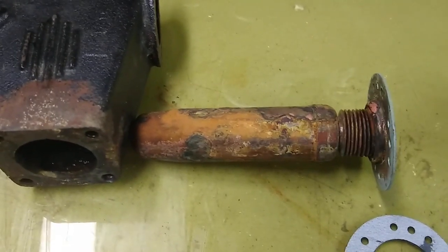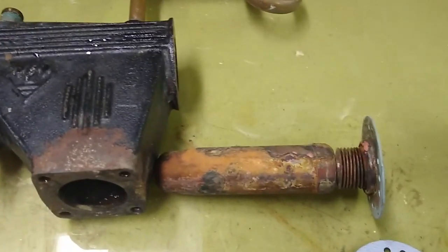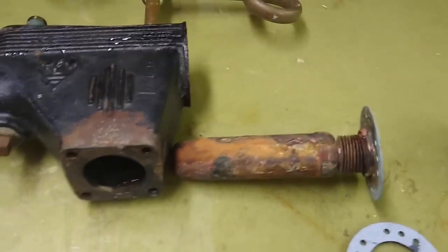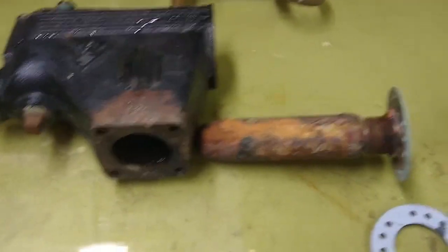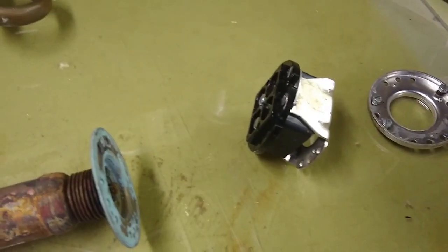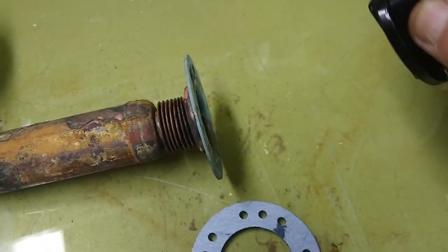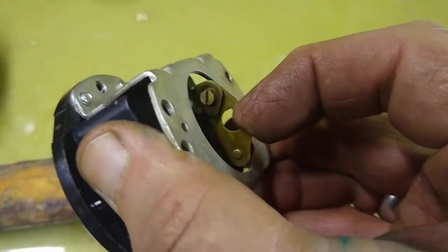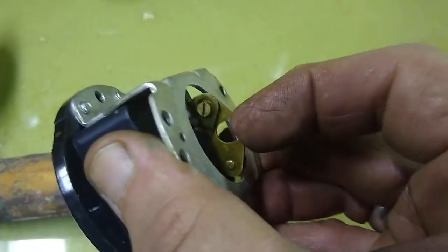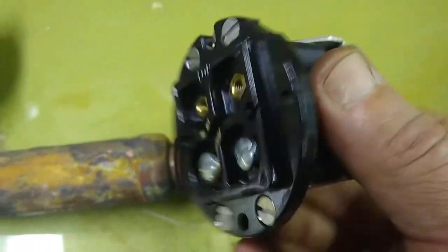Now I'm confident that it's functioning quite nicely and I'm going to be able to put it back together. As long as the switch is good — I couldn't tell whether the switch was good because I didn't get enough motion on it before — I could test it now with an ohmmeter to see whether when I click this from one position to another, it actually opens and closes those contacts.